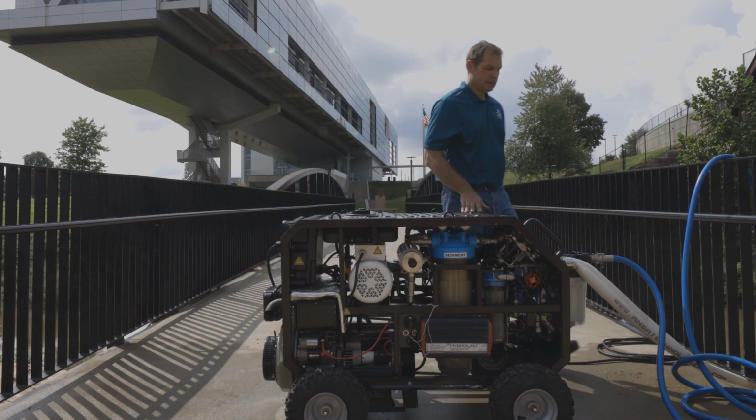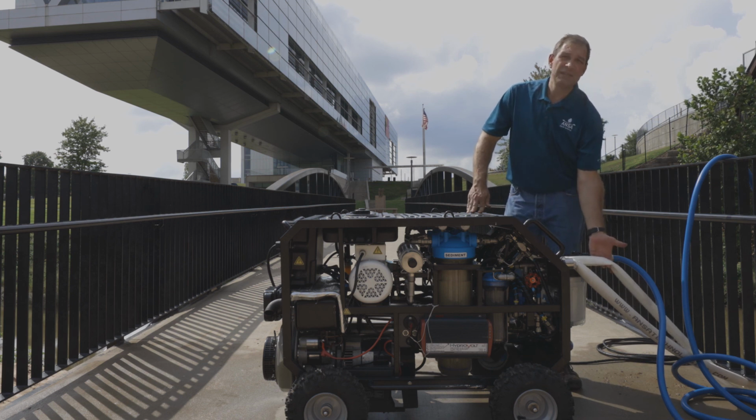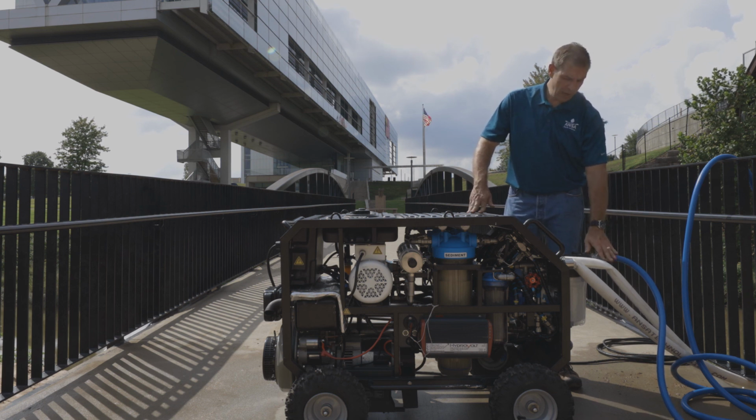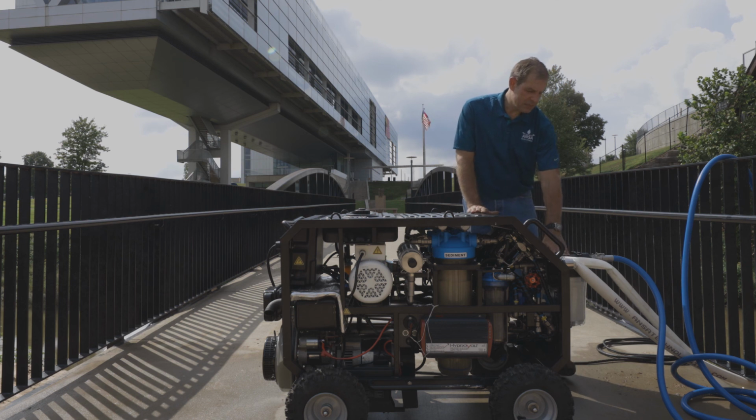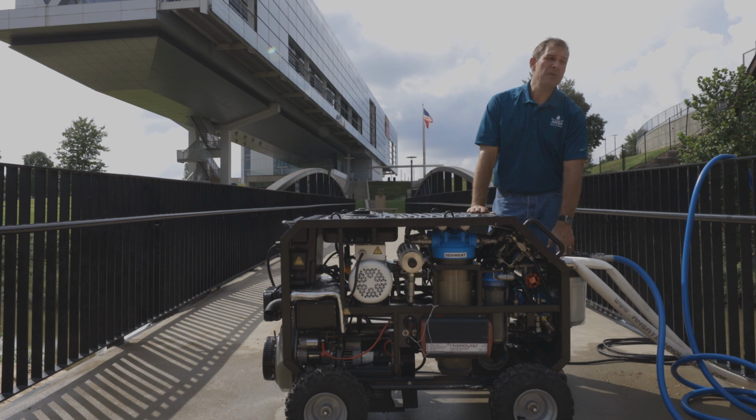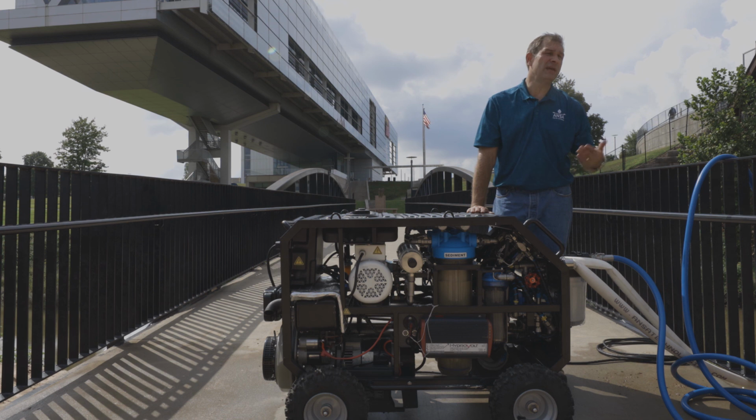So the middle hose is going to be the waste discharge, and then the blue hose here is the pure water that comes out. It's about a 4-to-1 ratio of the water. This last stage that is right here is a post-carbon filter, and the purpose of that is basically to take out any odor that might be in the water, if it's a stagnant aspect or stagnant water, flood water, that type of thing, which usually causes people not to drink it. If it smells bad, I'm not going to drink it regardless how pure it is. So that removes that barrier for them.